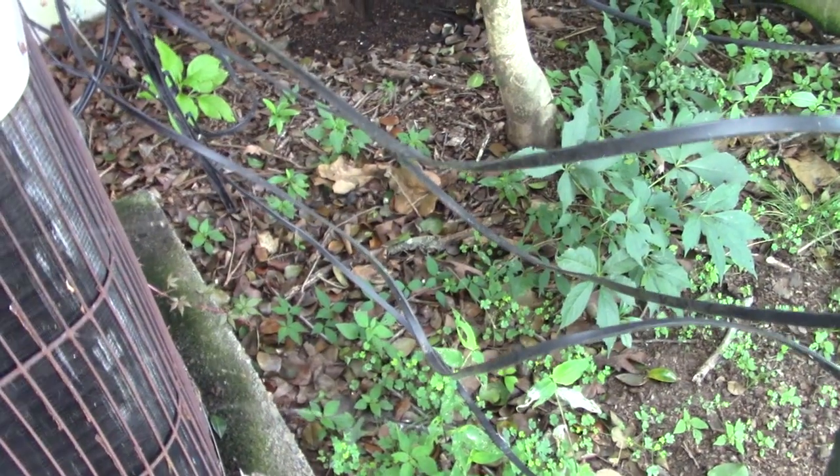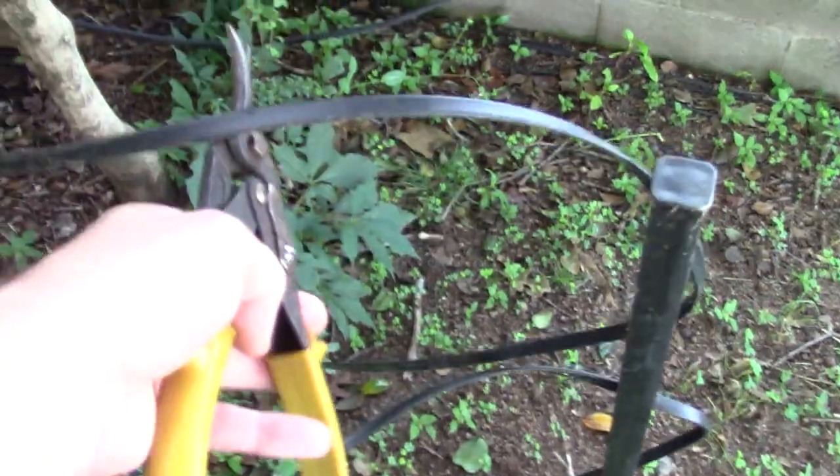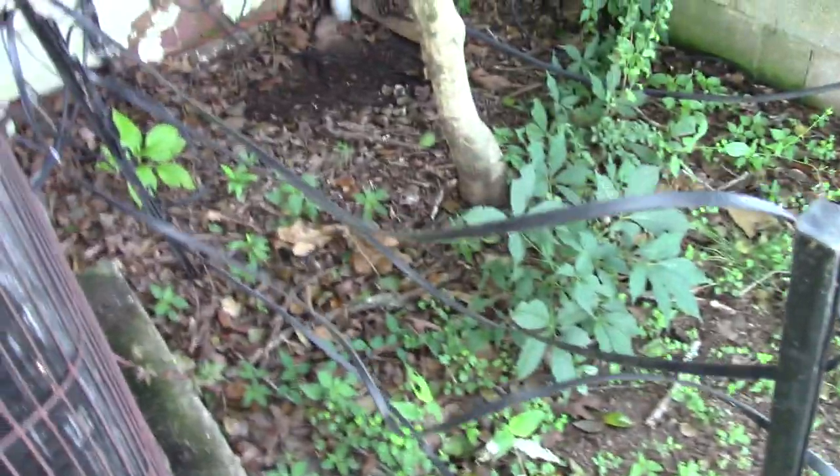So let's go cut the twin lead. You can do that right now. So there's no way to make this look pretty. So the thing about TV twin lead and communications is it can't touch the ground or anything metal. So you've got to suspend it in the air, and also it can be resonant. So what that means is certain lengths will make the antenna, the twin lead, be part of the antenna. So you've got to trial and error it a little bit. And sometimes it's got to be a little longer, sometimes a little shorter, the transmission line, the twin lead. So that's why it's wrapped around on those stakes. And back here, we just don't do landscaping. All our attention's out there, not in the property.